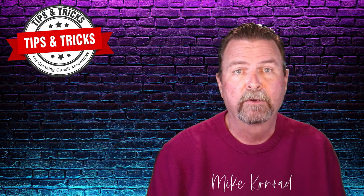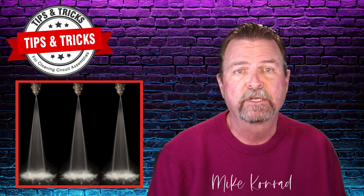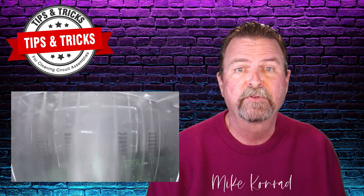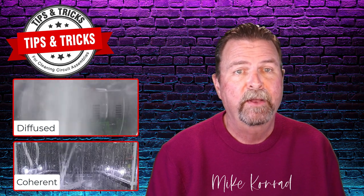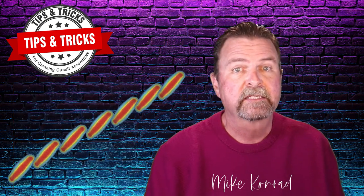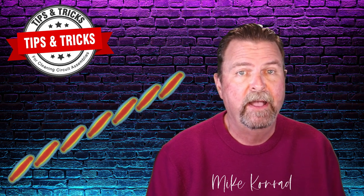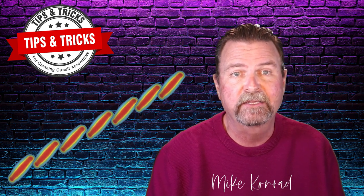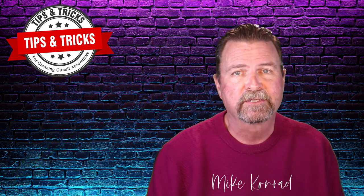Most cleaning machines designed to clean post-reflow circuit assemblies feature diffused fluid spray patterns. Here's a video of a cleaning machine equipped with a diffused spray nozzle. As you can see, there is far more energy distribution with diffused nozzles — so much so, we can't even see the back of the cleaning chamber when the spray bars are rotating. Now let's compare that to non-diffused spray patterns — as you can see, there is quite a difference. We can see on this diffused spray pattern pressure chart how pressure is more widely applied to the target. Also notice how the spray patterns are angled so that the distribution from the fluid from one nozzle does not directly impact the distribution of the fluid from the adjacent nozzle.